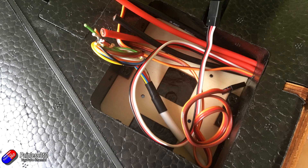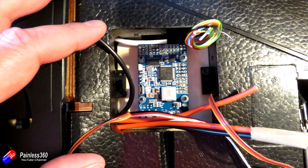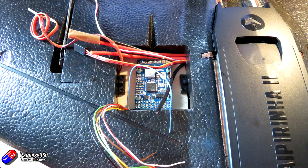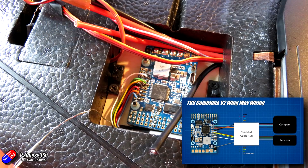Once that's done you can start making the ends off, and as you can see it is a little tight, so you do have to avoid using any of the pins. I pre-soldered all the spots on the flight controller I'm going to use — this makes soldering faster and ensures I don't accidentally solder something to the wrong pin. That bare wire in the bottom-left corner is the one I'll cover in heat shrink to ground the shield inside the cable. Speaking to Constantine, the father of iNav flight, he thinks that's probably overkill, though it's something he used to do — but since it's in the cable, I might as well make the end off.